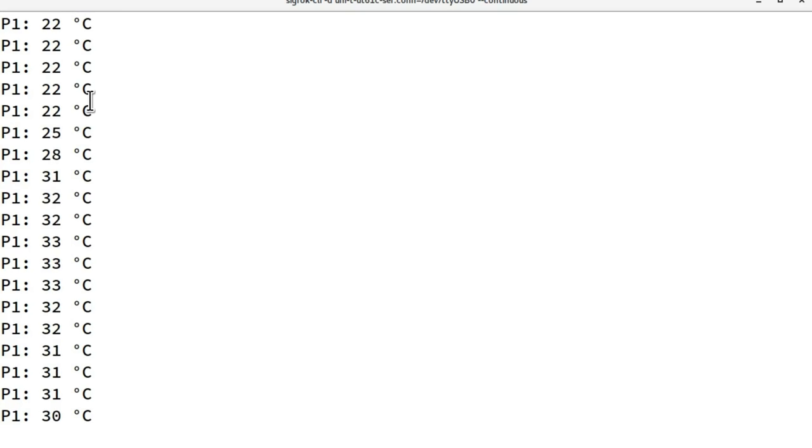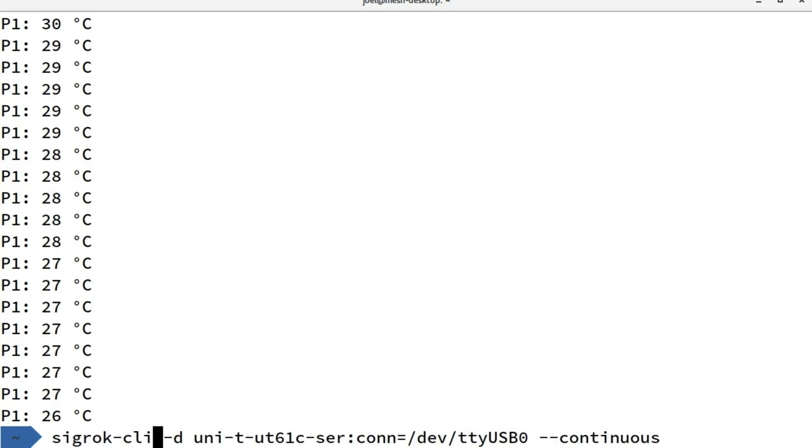Now, in this case, I'd rather use Sigrok Meter instead. Sigrok Meter is an unreleased application in the Sigrok suite, which will allow us to plot the output on a rolling graph. So if I kill sigrok-cli here, we just need to make a few adjustments to the arguments for Sigrok Meter. Running Sigrok Meter there, and we don't need the continuous option. So now if we go ahead and run that,